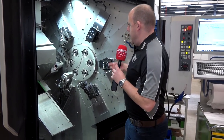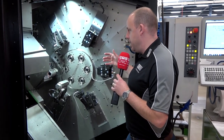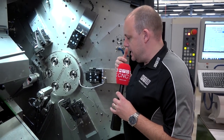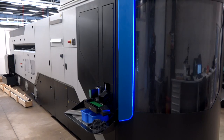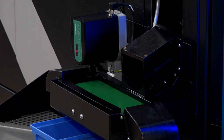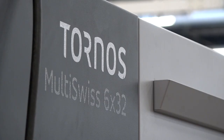These spindles run at 6,000 RPM on 32mm bar. Another key feature is the integration of swarf handling, swarf exit, and the bar loader — it's all in one footprint. So when you're laying out your machine shop, you don't need to account for lots of separate items like a separate bar feed. Everything is here, neat and tidy, making shop layout easy.